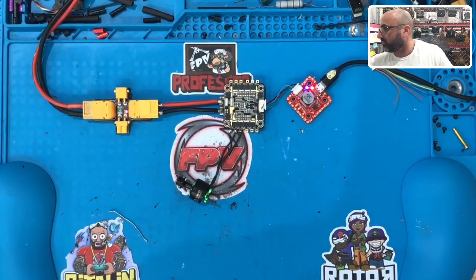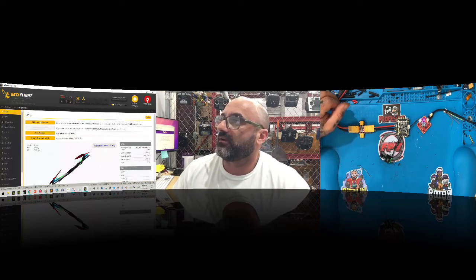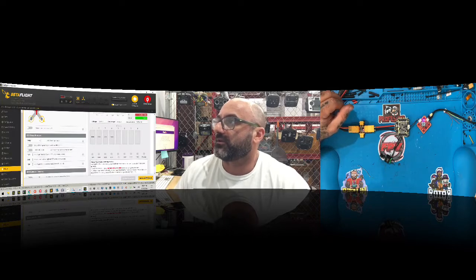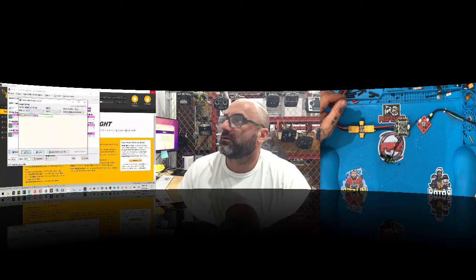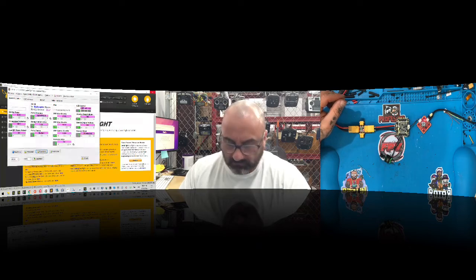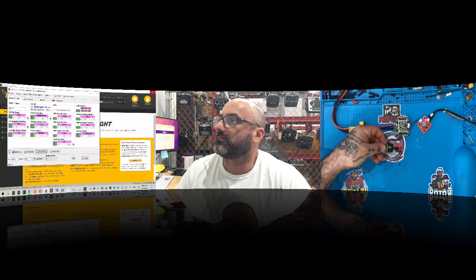Let's go ahead and get our screens here — split one, two, three. Move that over and log into Betaflight. I don't care about all that, but let's go to motors and see what our protocol is. It's set at DSHOT 600 — he was using PWM. So I'm going to click save and reboot. Now I'm going to head on over to BLHeli. I'm going to flash.